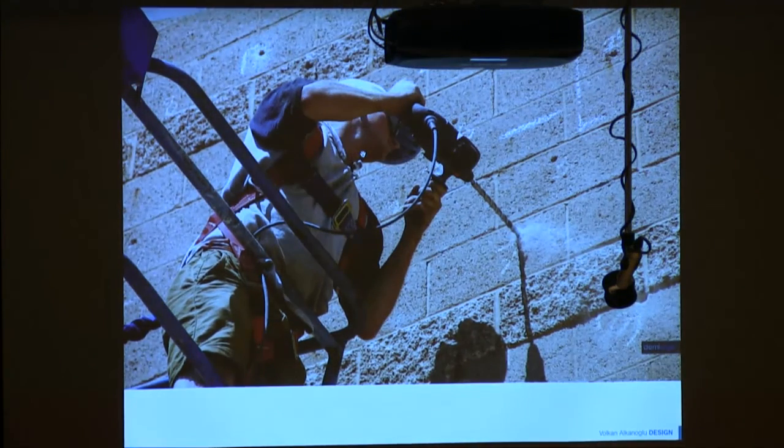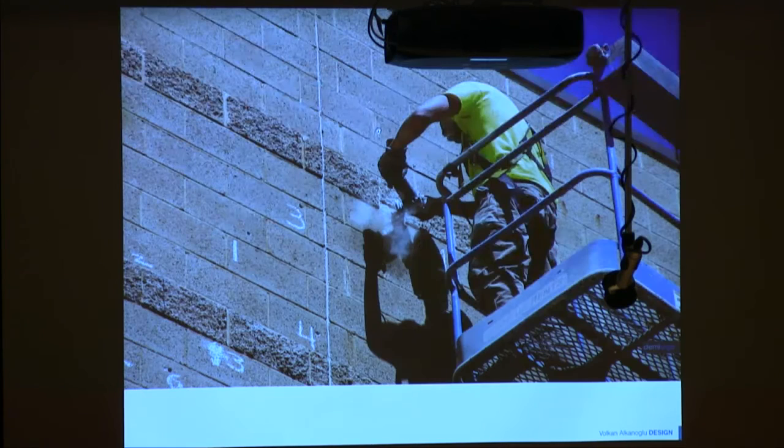And we had to drill holes, and there were lots of holes to be drilled as well. If you do this kind of work, you have to be careful that you don't mess with the building too much, because each building is designed to make sure that water doesn't go in, there are no leaks, and so on. So we had to come up with a detail that, A, doesn't penetrate the entire surface of the wall, and also seals the hole again. So we introduced an epoxy that, A, helps us seal the hole, but also helps us keep the anchor inside that hole and stabilizes it as well. But you can imagine there were lots of holes that had to be drilled for this.